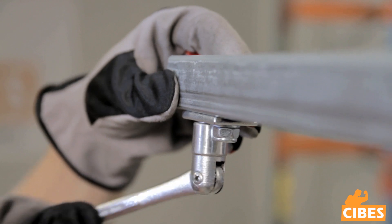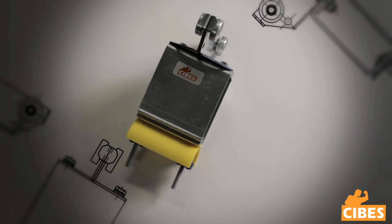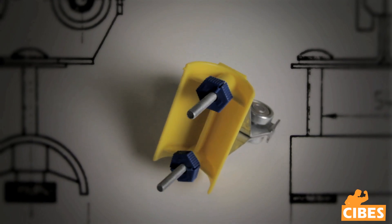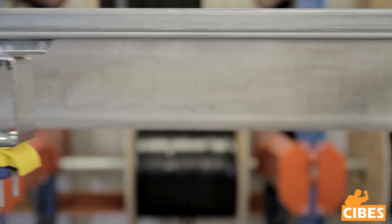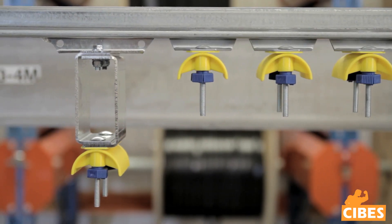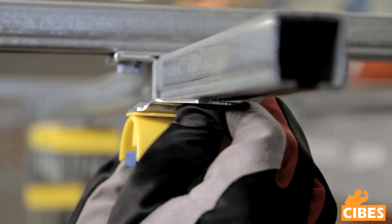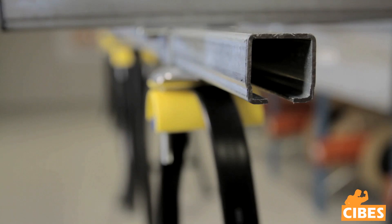Mount the stopper and insert the plastic plug at the end of the rail system. First, insert the towing trolley into the rail. Then mount the cable trolleys you selected for your system. The trolleys should run smoothly in the rail and across any connectors. Mount the end clamp, which is the starting point of the system. The end clamp is fixed and there must be one in every rail system. Make sure there is enough space for a stopper and an end plug.